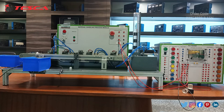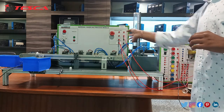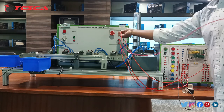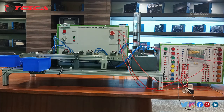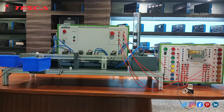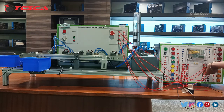Connect Y0 port with the motor. Next, connect Y1 port with the indicator. Then take another patch cord and connect valve 1 with Y2 port, valve 2 with Y3 port, and valve 3 with Y4 port.